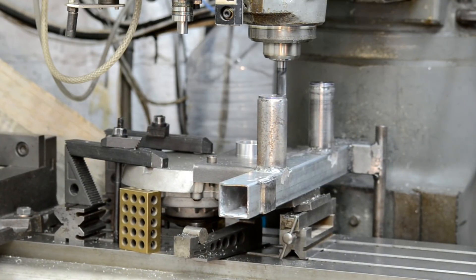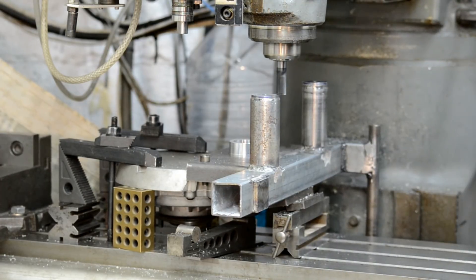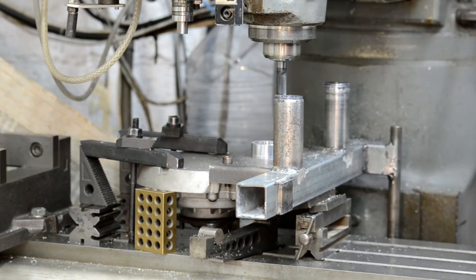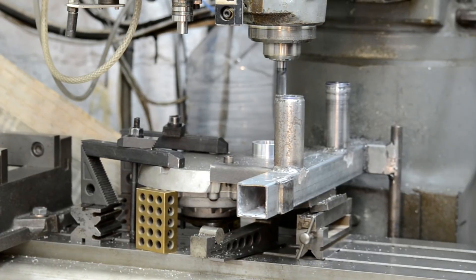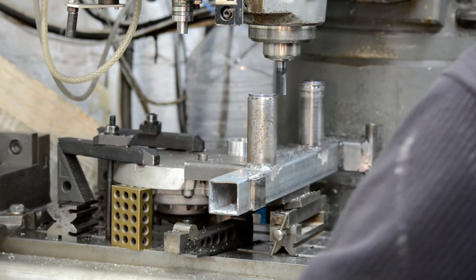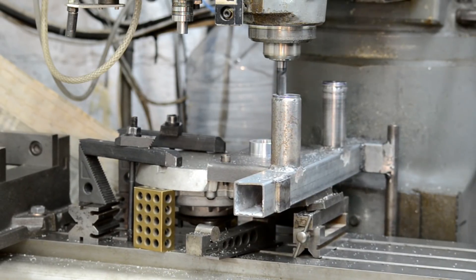It's a brand new milling cutter, running quite slowly because with a welded structure it's relatively flexible and chatter could be a problem. I've got quite a slow speed — only 1000 RPM on a half-inch milling cutter, so the surface feed is quite low. I've got relatively low overlap so the amount of cutting is small, and all this is to reduce the cutting forces to avoid chatter. And that seems to be successful — there is no sign of chatter at all.